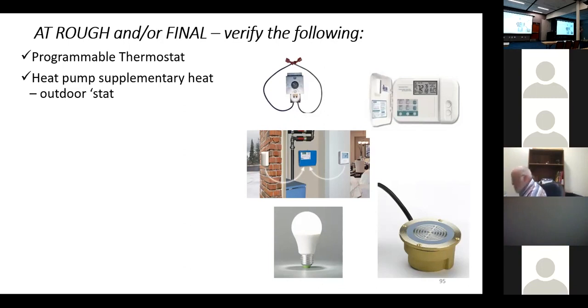The other part of the building that needs heat can grab the heat out of it. So in schools, we'll do that too, or big buildings where you always need to cool the middle and you're heating the outside. So you can heat and cool and just move the heat around in the building. And if you need to dump some in the ground, you dump it in the ground, or if you need to pull some out of the ground, you bring it back.